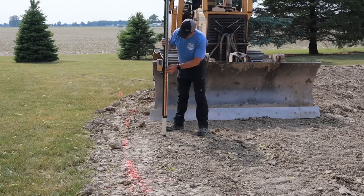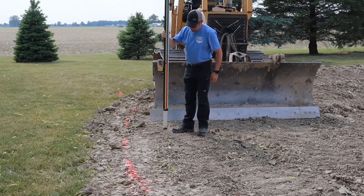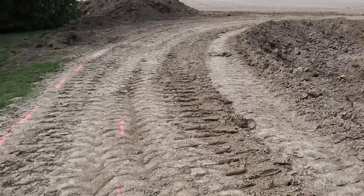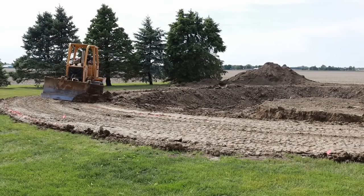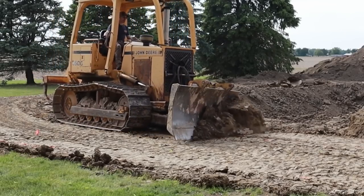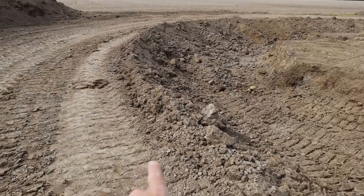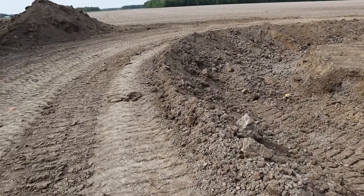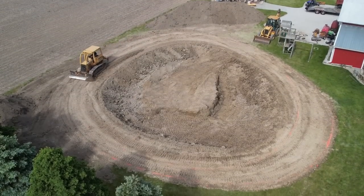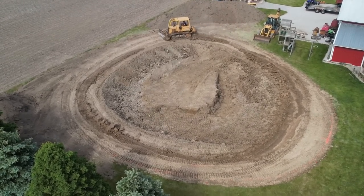This is marked out at four feet right now — I want a little bit of room on each side of the sidewalk to get it formed up; nine-point-eight is my target on top. My concrete will be up here and then I will taper dirt out away from it. My top's pretty close, but I've got to come along with the dozer now and start cutting this bank down. I've got to cut out all this dirt I filled in — I filled it in level so I could compact it, so that whole layer is like a keyway. It's just a matter of jumping on the dozer — as I start peeling this down it'll fill in where I've already dug out. The dozer is the easiest thing because it gives you a line and allows you to make it consistent.